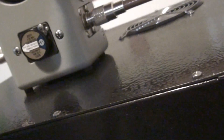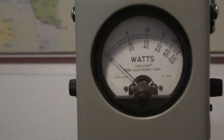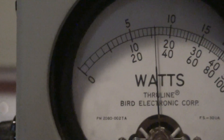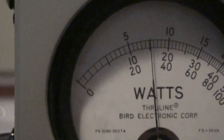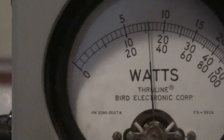All we're going to do is go up here and go on peak. Still on the bottom scale. Hello radio, 1, 2. 40 is 4,000, and that hash mark right before is 3,000. Hello, 1, 2. Audio, 1, 2. We're hitting 3,100, 3,200 watts — something like that on peak.